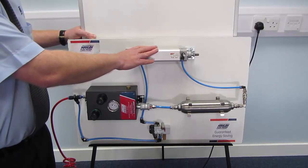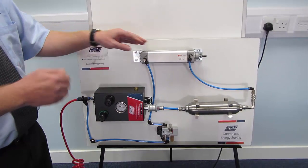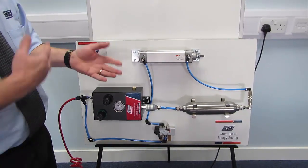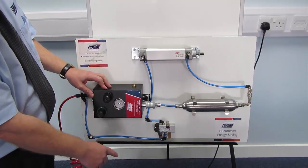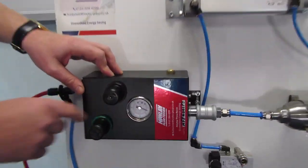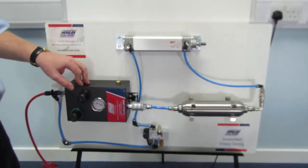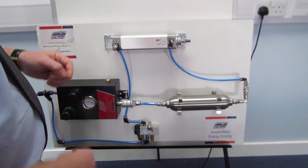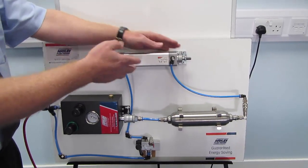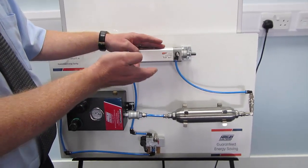So we've now had 21 complete cycles out of the same amount of volume of air that we had before — the 8 litres. So in effect, we've increased or recycled 50% of the air that we've normally exhausted and reused that. The other thing to note is that we were running from 7 bar before for the normal circuit. We've actually reduced the pressure to 1.5 bar, or just over. So that's also a saving. We've not lost any speed. We've reduced the pressure, but we can do that because most of the time the cylinders are over-sized, running at the same line pressure that everything else would be on, where it can usually be reduced.